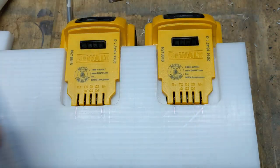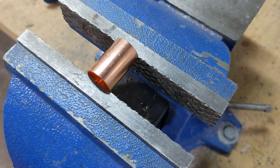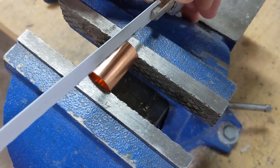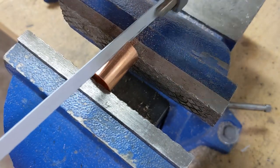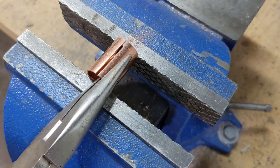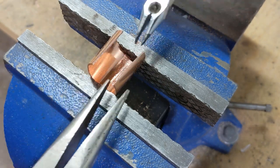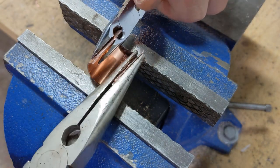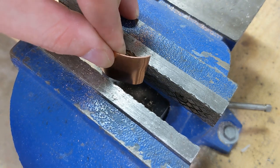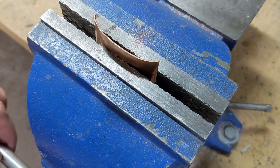Now for the electrical contacts. I just need a sheet of copper. I found a copper pipe coupler in my plumbing box — it looks like the right thickness, I think I can make it work. What I didn't show here is that I sanded the whole surface of the copper with a scotch-brite pad. I think there's a layer of varnish or something on these which would interfere with the conductivity of the copper.